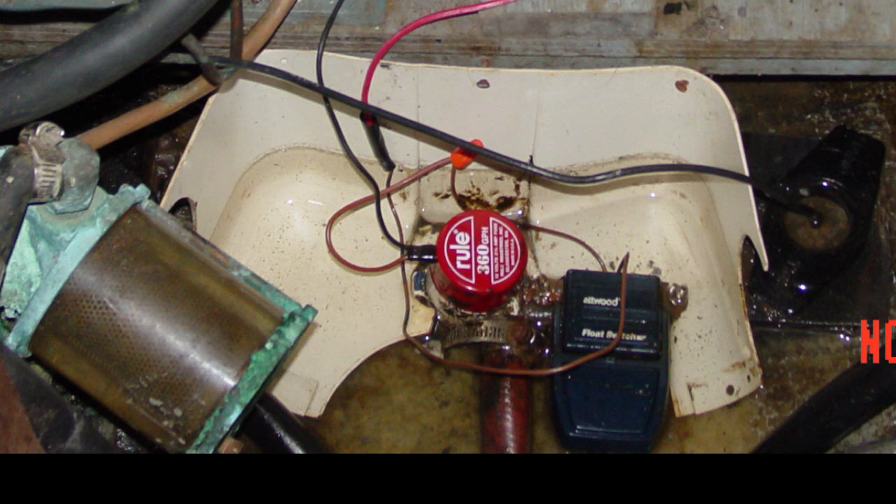While we're down here at the bilge pump, two other things we don't like to see: twist-on wire nuts and tape joints. The wire nut will eventually fall off due to vibration. The tape will eventually fall off, gets old and unravels. In both cases, they can leave exposed positive wires that can provide a shock hazard or arcing and sparking as they bounce around. Both of these wire connections should be made with proper marine-grade connectors, preferably those with attached heat shrink tubing to prevent moisture entry and corrosion.